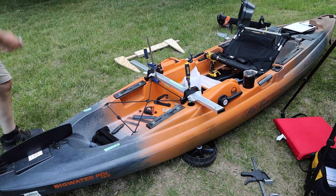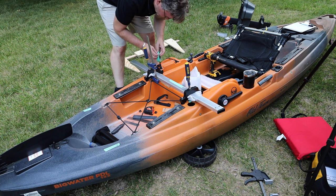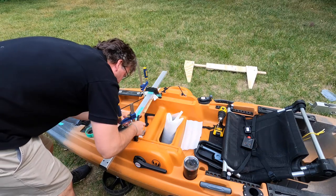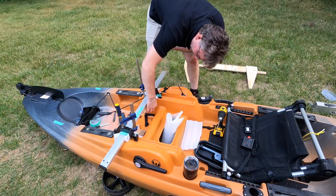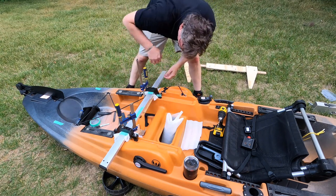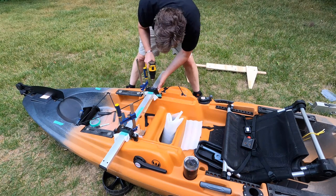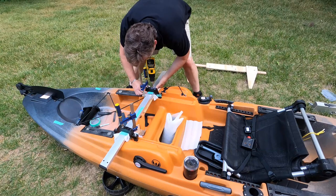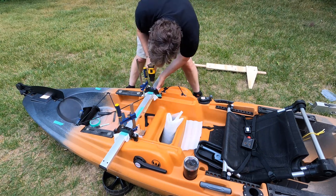I'm going to go ahead and start to drill some holes. I'm going to mark the inside and the outside right next to the gorilla bracket, kind of mark on the crossmember where the inside and outside is. I've put a couple of skinny pieces of plywood — half inch or less — underneath the gorilla bracket just to prop it up, along with a clamp. I'll use the gorilla bracket as a guide to drill the hole into the crossmember, double-checking the alignment left to right before punching through.